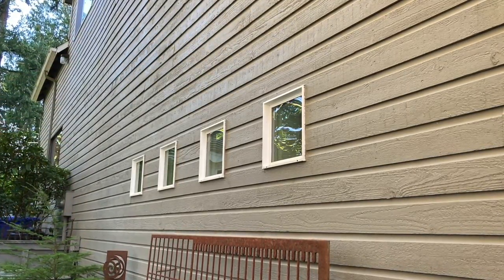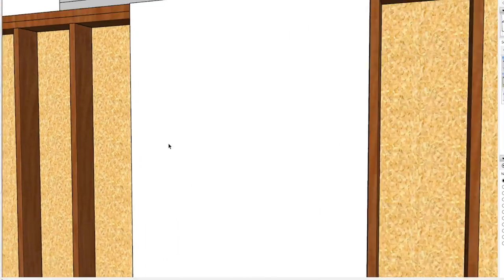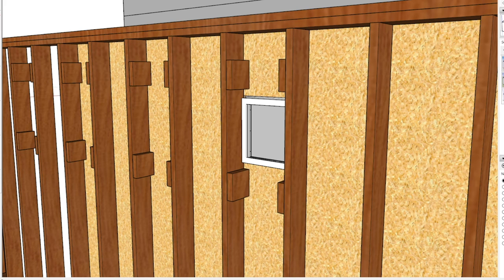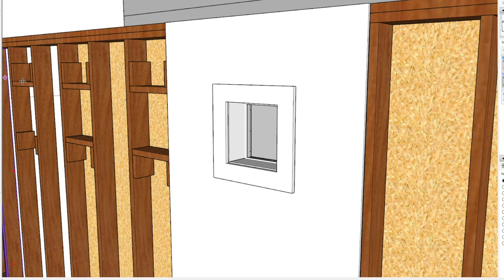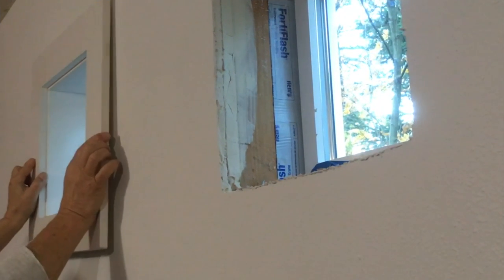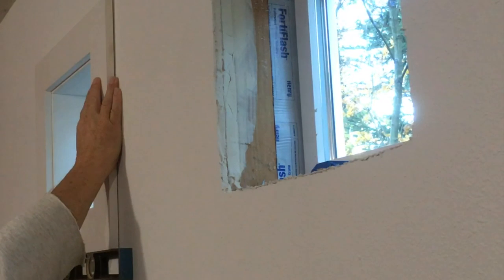As far as the inside, I was able to do everything through the 14-and-a-half-inch square hole. I cut a hole in the sheetrock and put blocking in top, bottom, left, and right, and put a top and bottom two-by-six in — all done through the hole. Once you have that hole, you just slide in your finished trim and face frame.